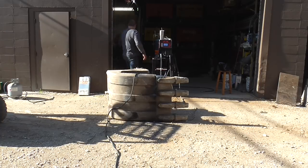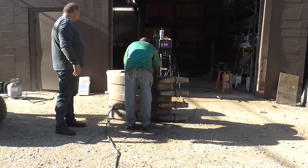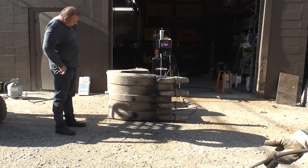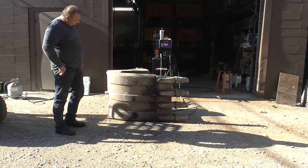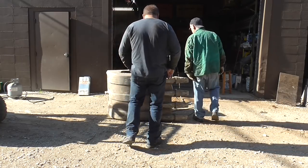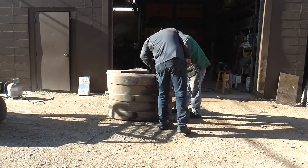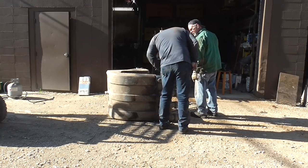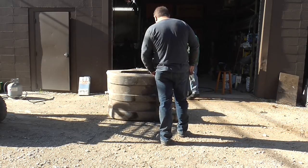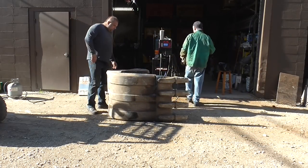Here you are witnessing the most important part of the job, which we call final inspection. Everybody's coming around, gathering, looking at this, seeing what happened, if the crack is gouged out deep enough, if we left anything. So sometimes just step back, take five, and have everybody look at it, see if you see anything. Whatever part you missed there is critical to the success of the job later on. If you didn't go deep enough, if you had any inclusions in there, you're going to bake this right into your root. You're going to set yourself up for failure. If you don't have a good root pass in there, then whatever you do from there on can just not be very successful.